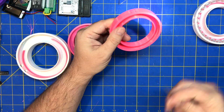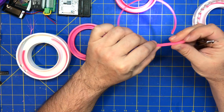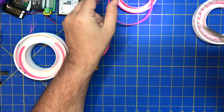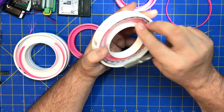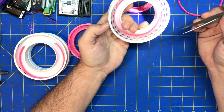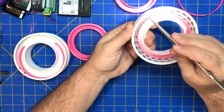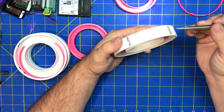I'm just testing different thicknesses of springs. There's one, I think this is 1.5 millimeter. That's 2. Somewhere in between might be the perfect amount. Some of them fail. So this here is the bigger one. This is the 18. Sorry, this is the 16 millimeter. And each revision, I'm just making changes to these openings to figure out what kind of curves I need on the inside, and to see what the spacing of these needs to be.